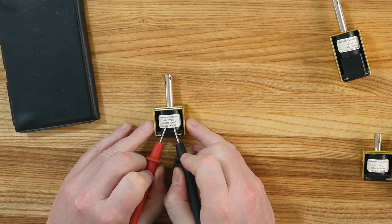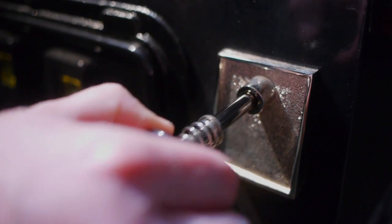And then also in the background, Felix is going to be working on the Teensy 3.1, which is a pretty popular microcontroller that's based off a Freescale system on a chip. And what he's going to do with that is try to get the DAC working, the digital analog converter, so we can use it to play music and sound effects. Sounds like we've got a lot of work to do. Let's get flipping.